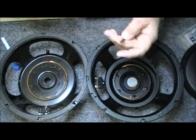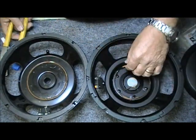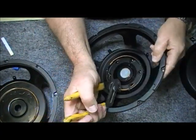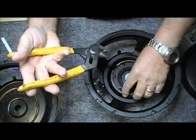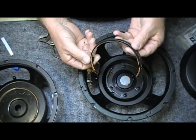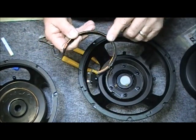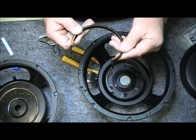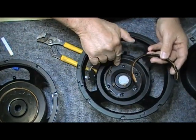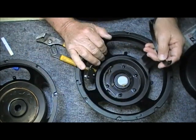We just busted that out of there. If that was metal, I could not do that. This is ABS plastic. They cut a ring of plastic, use it for a spacer. You can see how I pulled that right off of there. I can't sand on this. I can't clean the gasket off. It's just going to tear the plastic up. A lot of times this plastic doesn't stay into the glue. It comes right loose, rattles like hell, and basically it's another doorstop.